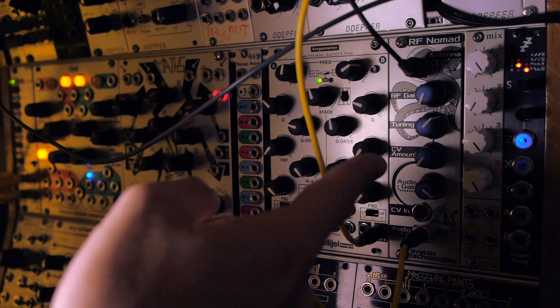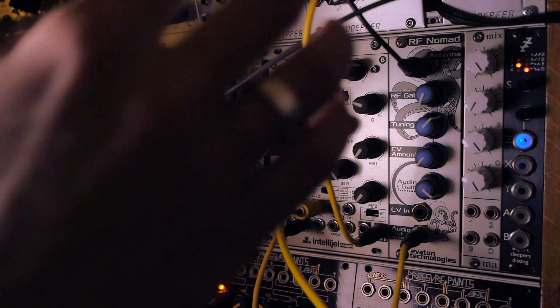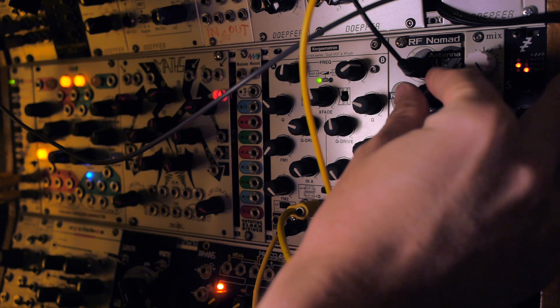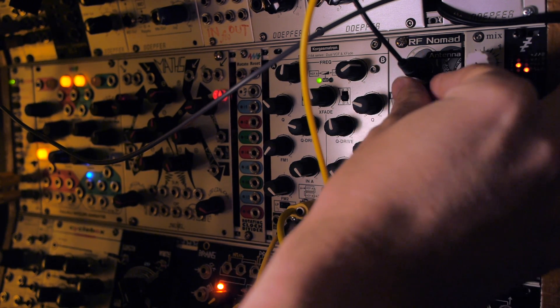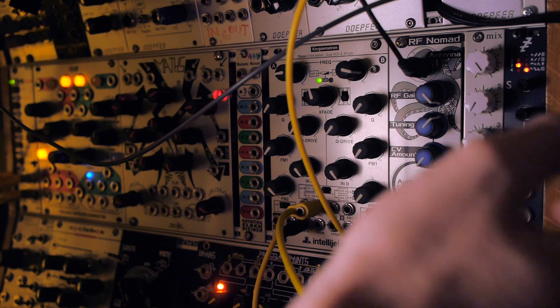I was advised by Russ to get the aerial away from metal objects — obviously the module itself is a metal object, but keep it away from other metal objects. If you do that it definitely helps. You have a dial at the top for RF gain, which goes from nothing to very loud — so loud that it kind of distorts internally, which is awesome.